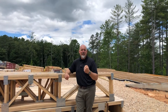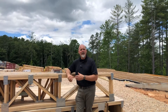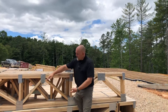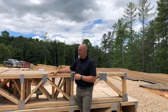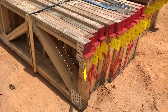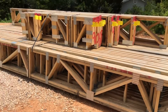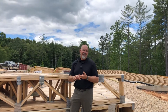Engineered floor truss solutions are generally more sustainable and more environmentally friendly. As you can tell from this engineered floor truss, one of the reasons they're more sustainable is we're using very short pieces of lumber — we don't need to harvest long straight trees to build floor trusses. Overall, a fantastic product. We love using engineered floor trusses because it allows us to build homes that are extremely sturdy and strong, and it allows us to keep our heating and cooling ductwork inside the conditioned envelope of the house, which is extremely important with regard to energy efficiency, performance, and indoor air quality.